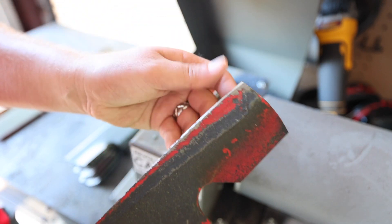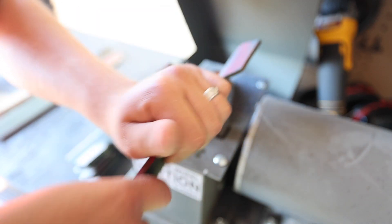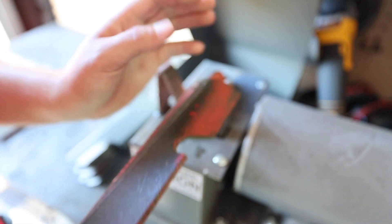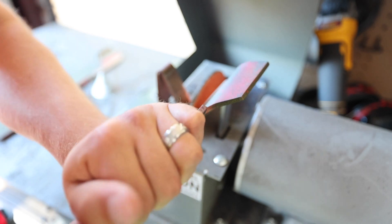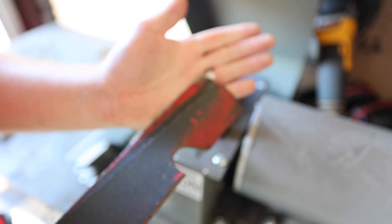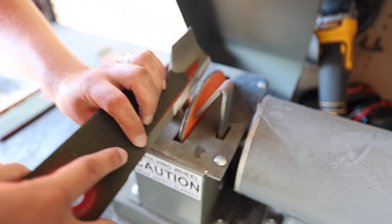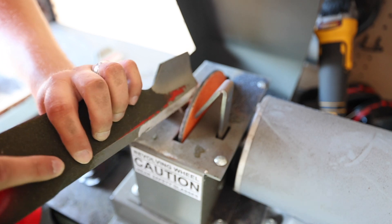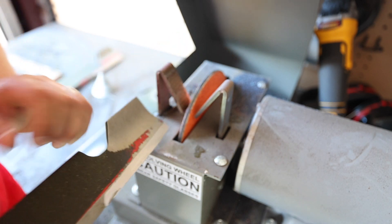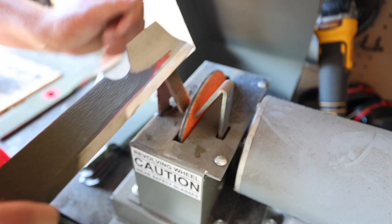We don't want just a sharp angle with a dip off — we want to keep that 30-degree angle the whole way down and use the flick technique for that last millimeter when the blade isn't fully sitting in the cradle. On the back side we cleaned up burrs, small nicks, and dings with one or two quick passes — just put it in the cradle in reverse and flick it back. Then for the remaining small nicks, we used the top last millimeter of the wheel to grind and clean them out.